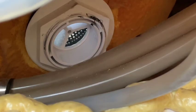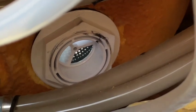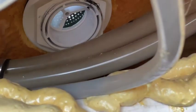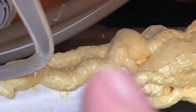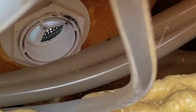That's ready for the plumbing. Placement of these suctions — I only had one spot where there wasn't enough room on that side, so the only place I could get them 600mm apart was where I put them. On the other one you can see with the airlines — this one's got water lines. Because this spa is old those water lines have gone hard as a rock and won't flex out of the way. What I'm going to do is cut them at this sort of level, cut them both through, bend them down out of the way, then put a little joiner in because they're tight through to the manifold. That way I'll be able to get the plumbing in and connect this suction up.